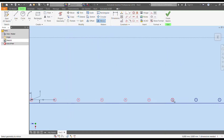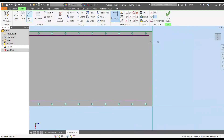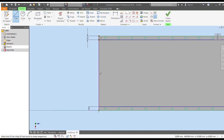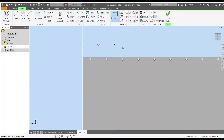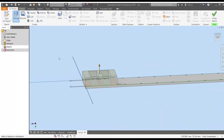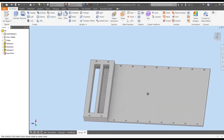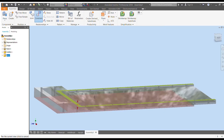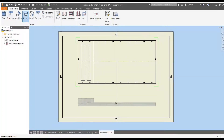The first thing we had to do was design and build the apparatus. We did the calculations for the geometry in order to get a reasonable speed during the experiment. The Reynolds number we aimed for was around 10. After that we proceeded to do the CAD design and then laser-cut it. The plates must be transparent, which is why we cut them in plexiglass. The parts in the middle - the seal and the cross sections of the figures - are made of plastic.